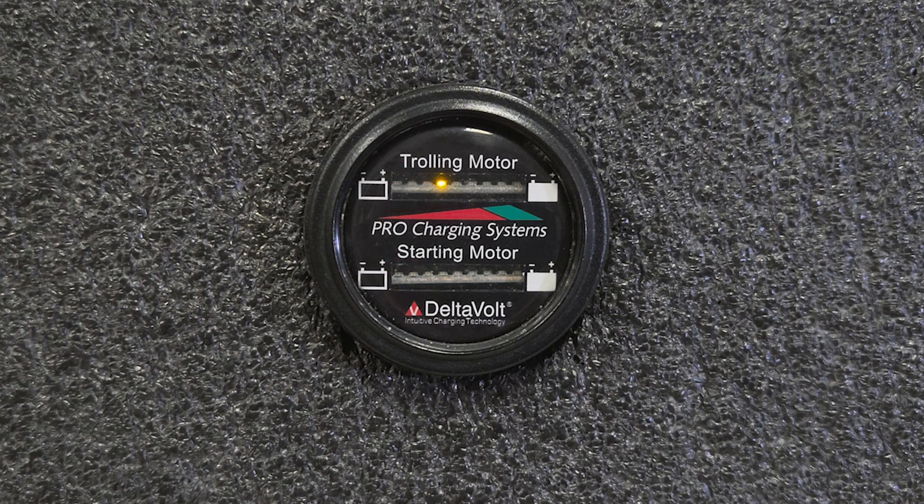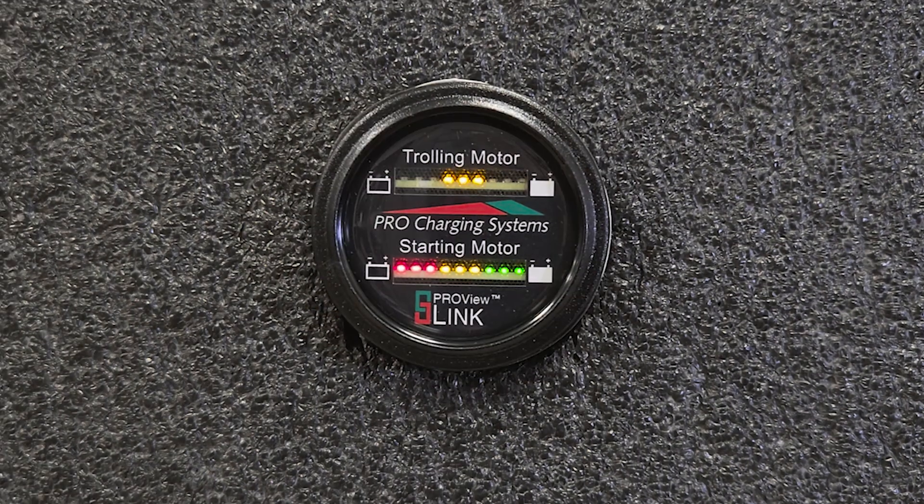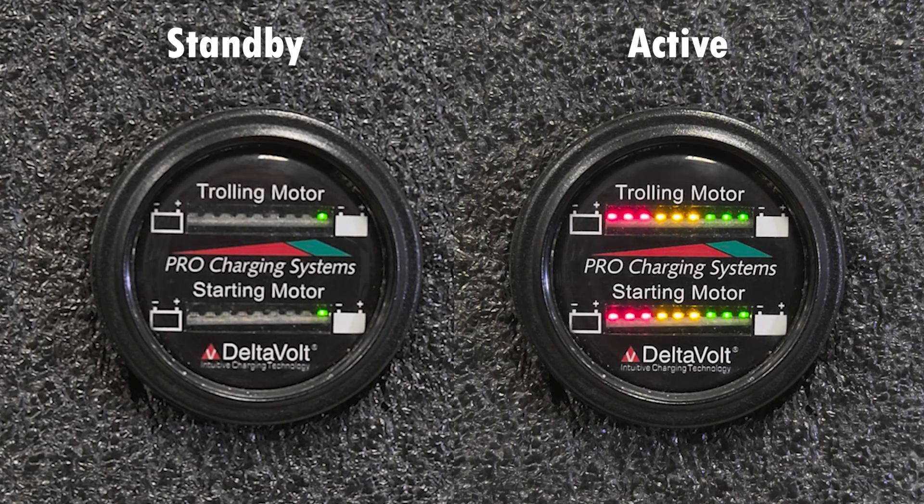We now want to power up the gauge and verify everything is functioning correctly. The lights on our standard gauge will flash an initial startup sequence and then show the current level of charge on the battery pack it's connected to. You will have three red, three amber, and three green lights to signify the level of charge. If it is a lithium model, you will start by having three amber lights flashing on the gauge until 13.8 volts is reached per 12-volt battery connected. Once this threshold is met, it too will switch to your current battery level. The gauge will switch into a standby mode after 60 minutes of inactivity on your battery pack and have one light showing for the current charge level.